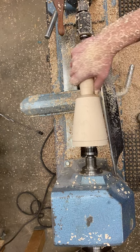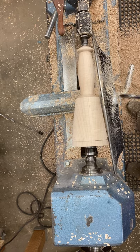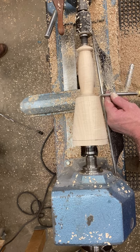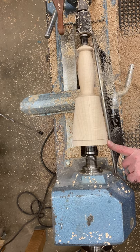Just like that. And remember that that is just that V-cut. It's the one that we used when we went to make the dovetail to put into the four-jaw chuck. I didn't open or close the flute, 40 degrees to the work, skewed about 10 or 12. All I did was pick the handle up, engage that lower wing so that I could make that slicing cut coming downhill.